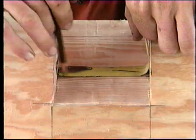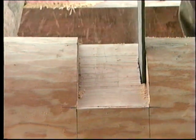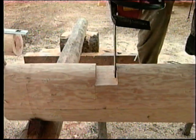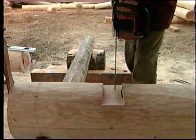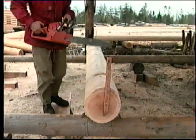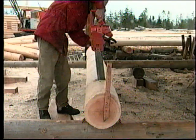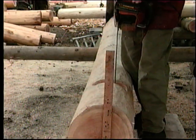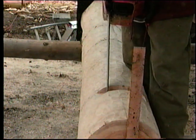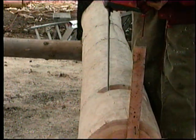This mortise will be cut 100 millimeters deep. The end cuts can be made vertically by keeping the saw parallel to the shoulder. The side cuts can be judged by using a vertical reference. If the side cuts are a little inside the line, there will be material to make a correction, and the final size can be determined with a template and a square.